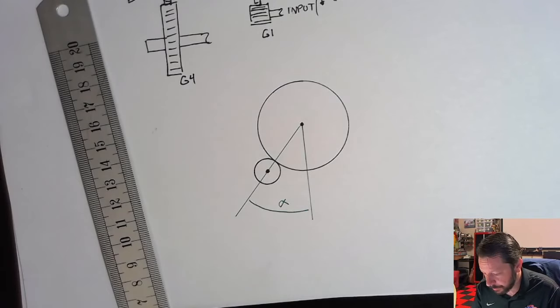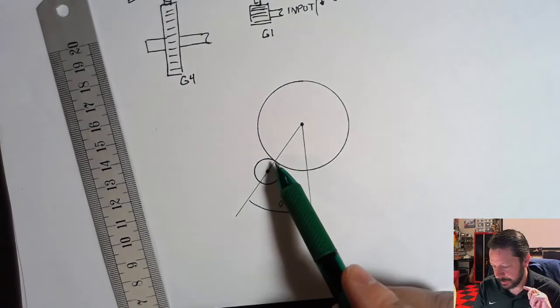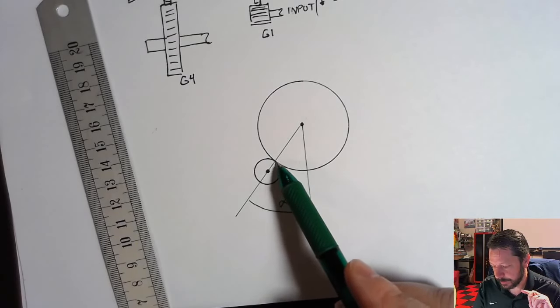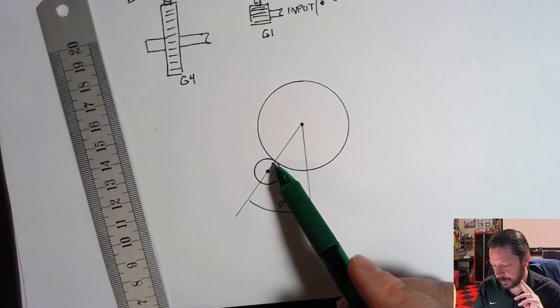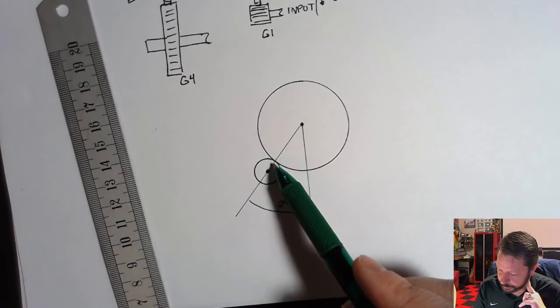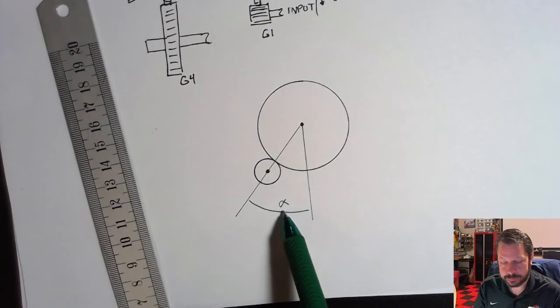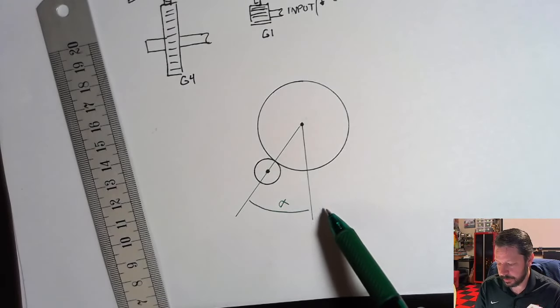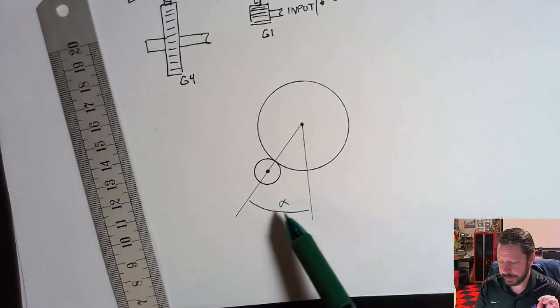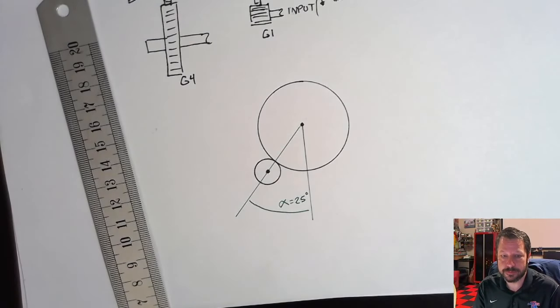The other crucial piece of information in the description is the pressure angle for the gear teeth. I did kind of draw the teeth on this guy. This is where the pitch line is, where the gears actually make contact with one another, showing the pitch diameter. The pressure angle for whatever gear set you have is the same as this angle alpha, and for three and four, the angle beta, which I believe for everyone is the same as alpha. So for me, alpha is 25 degrees, and I think it's 25 degrees for most of your problems also.